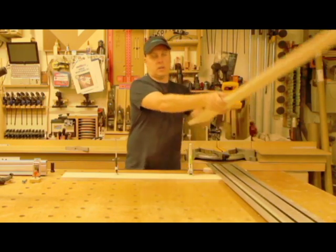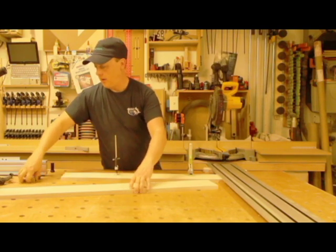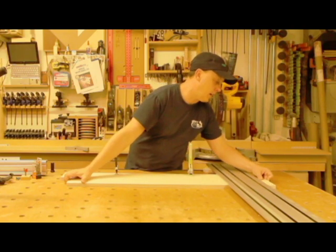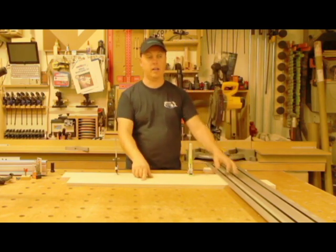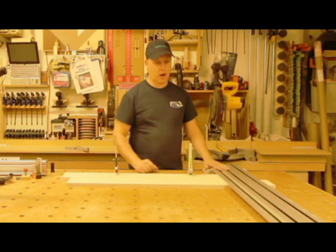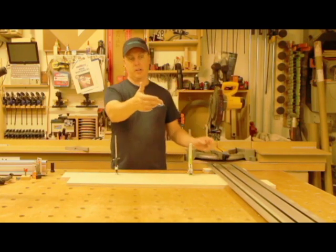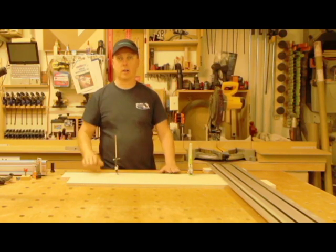When you're going to cut wood, I've got a line drawn on here. Essentially, you can just drop it in, pull your wood out to your line, and line it up with your edge. And because this is at a 90, all your cuts are going to be at 90. You can put your track saw on it and just cut across. I keep a little scrap of wood on either side. I would normally be working from the other side cutting, so I can easily lift up a little bit to slide wood underneath in order to get lined up. And then you can make your cross cuts all day.